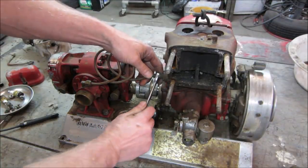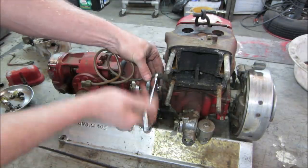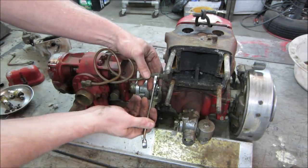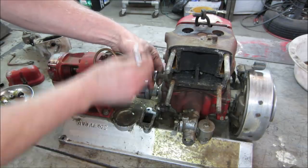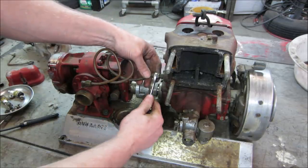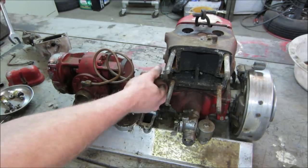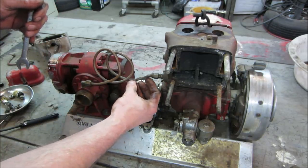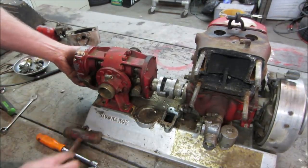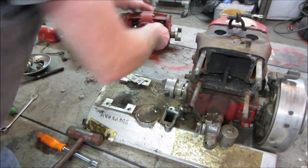Yeah, you just go take that pump right off. It's only got 4 bolts and another cooling line going to it. And we'll let it survive. That is 5/8. It's like it had some kind of information tag on it at one point. It's got a piece of wire hanging on it. Yeah, the bolt's out of it. Let's see if it'll just slide back for us. Yeah. Don't even have to hit it with a hammer. Just threaten it. It's got shims under it. I should probably mark where those are.